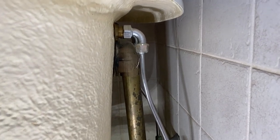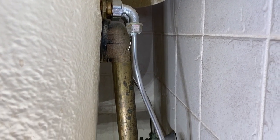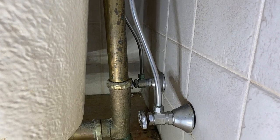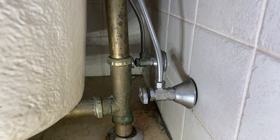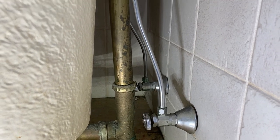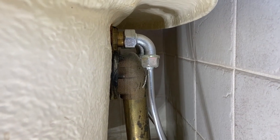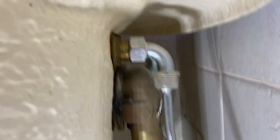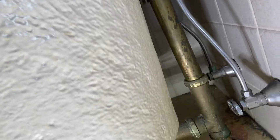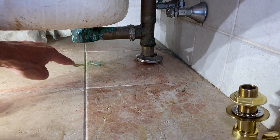From behind you can see how they retrofitted things — there are gooseneck connections with traditional speedy connectors. I thought we had valves and I wouldn't have to shut the house off, but unfortunately those valves did not hold water, so I had to go down to the basement and shut the water off. You can see that's an actual trip waste, which leads me to believe this was a more modern install, since vintage tubs like this usually don't have a trip waste assembly.